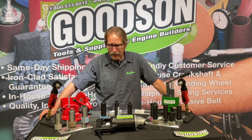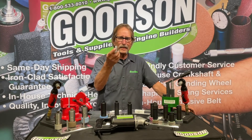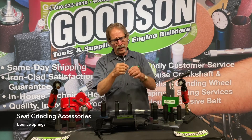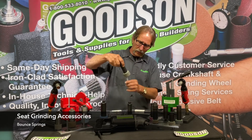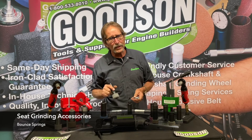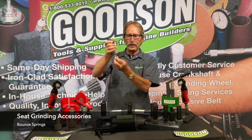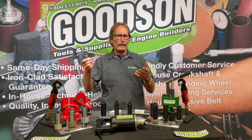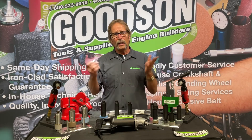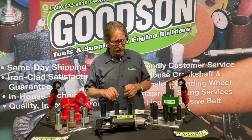There's still a lot of seat grinding happening. One thing I don't want you guys to forget is this spring right here — it's called a bounce spring. I'm a big believer in them. What they do is put pressure coming up as the stone holders are putting pressure going down. When you're done, it pops that seat grinding stone right off the valve seat, so you don't have a stop-start mark on the seat when it's done grinding. You let off the pressure and it just pushes it right up. It'll also help stabilize that stone and help prevent chatter.